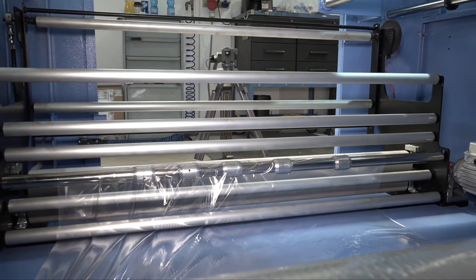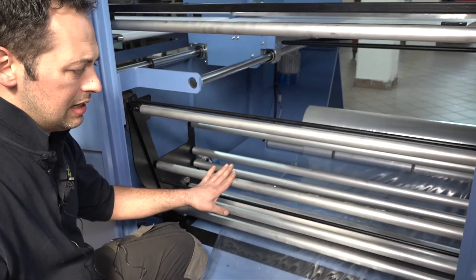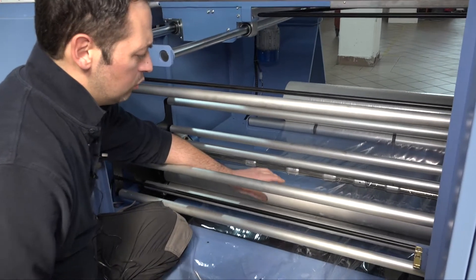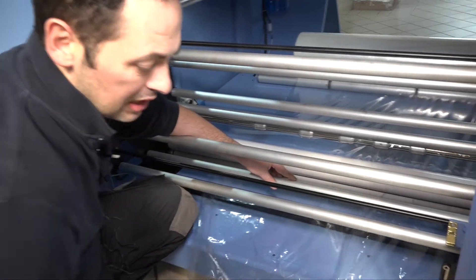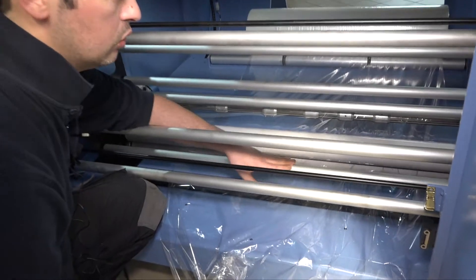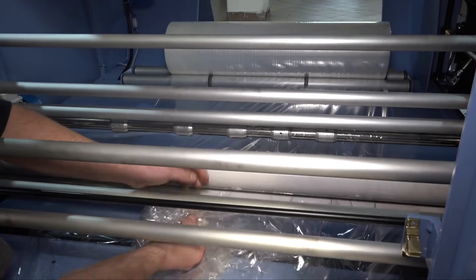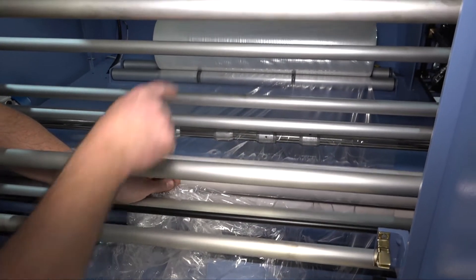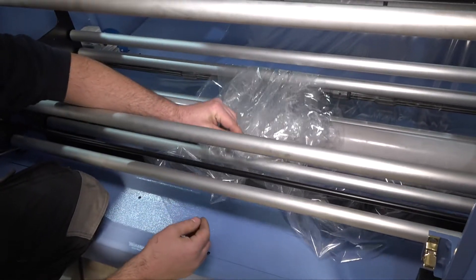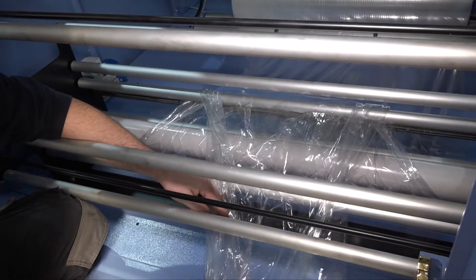After these four rollers, we go to the other side of the machine. As you can see, the film roll is coming out from the two rubber rollers. After it comes out from the two rubber rollers, the film has to go under the first aluminium shaft and then with movement forward and backwards, the film has to go through all the aluminium shafts.